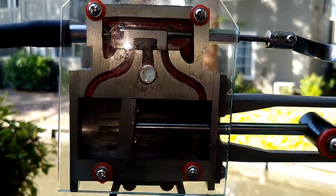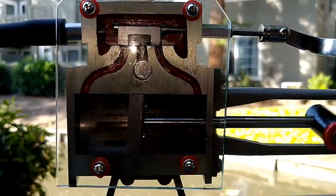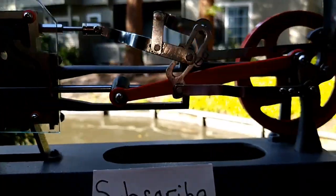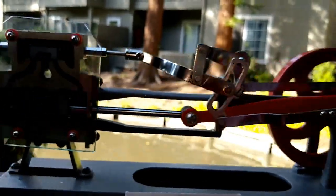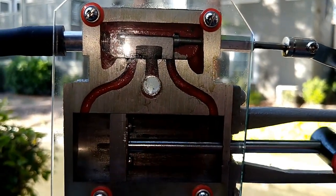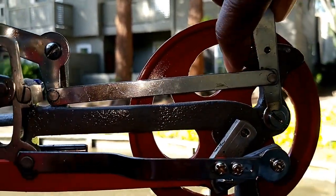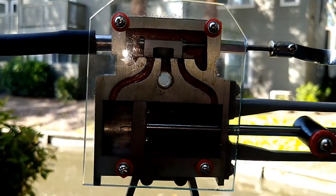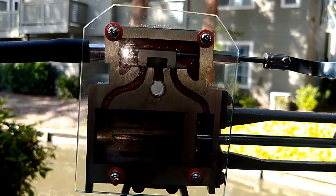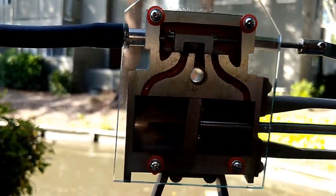What you have essentially is a piston that is in center now, so when it's in neutral you don't see much valve movement at all. You can see it rotating here but there's no valve movement - the valve is just steady in the center. Then you would hook it up, push it into full forward gear, and now when we rotate it you see the valve moving in relation to where the piston is.